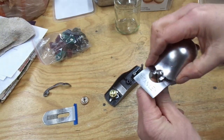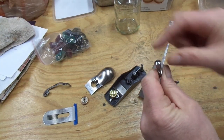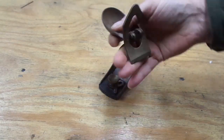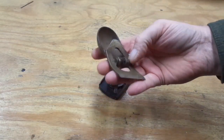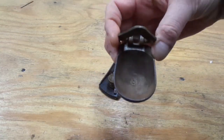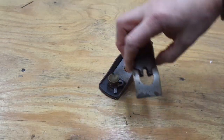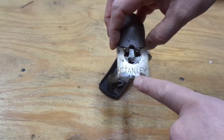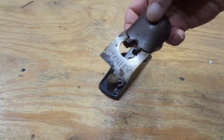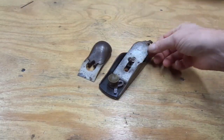I think the problem is the lever action of the knuckle joint kind of beats up the underside of the screw. Taking this apart, here is the lever cap — it's a simple two-piece design with a couple of pins holding it at the pivot point. There's a letter B cast into the underside of the spoon section. It says Stanley across the front. Other ones have a patent date, but this particular type does not. And you can see the plating on it is completely gone in the upper section and pretty flaky on the secondary piece.